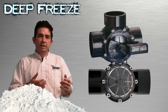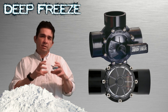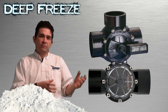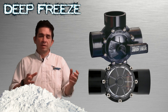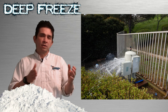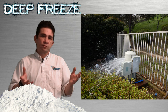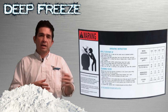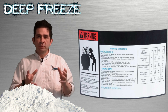As Harold Evans said, before you start your pool up, definitely check the valves and make sure they're not obstructed before the pump. Check the check valves after the filter to make sure they're not obstructed, because that could be very hazardous when you turn on the pool equipment and no water is going through the filter. That filter tank could definitely explode right in front of you, causing injury and also death. So be very careful when you turn your system back on after everything has been frozen.